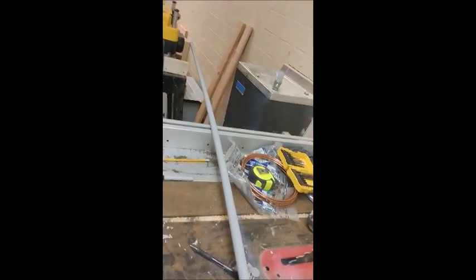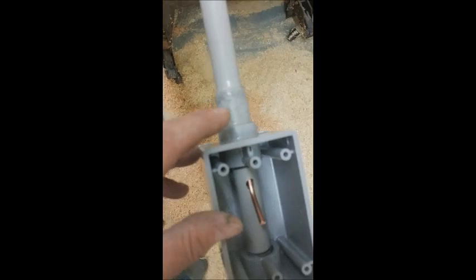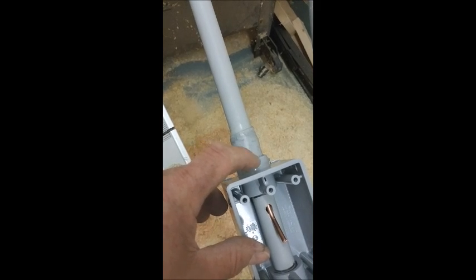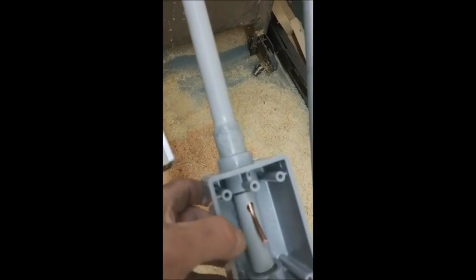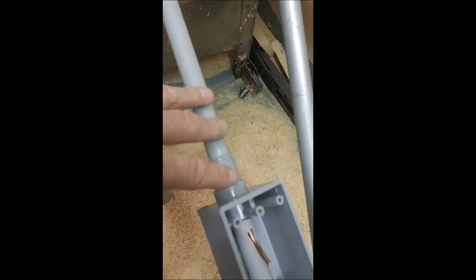Here's what I've got so far. I cut off my 10-foot stick of PVC, already glued the cap on, and I've got my copper wire inside it — so it's sealed. This box is going to be looking down. It turns out that the bell end of a PVC pipe will glue into a three quarter inch PVC electrical work box, so it seals tight and water can't get in. This end here will be looking up, so as the water comes down, the mast is sealed inside the coupling, and the coupling is sealed inside the box.